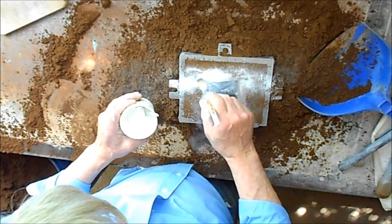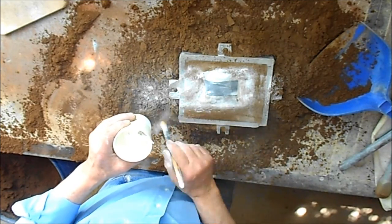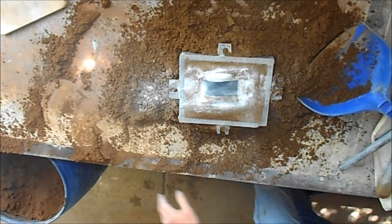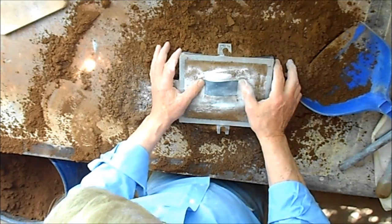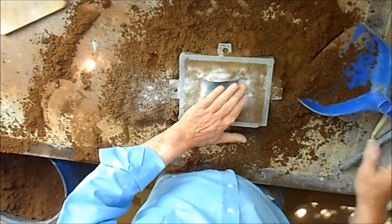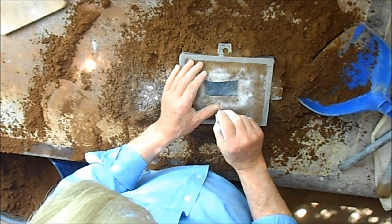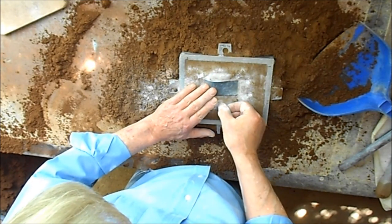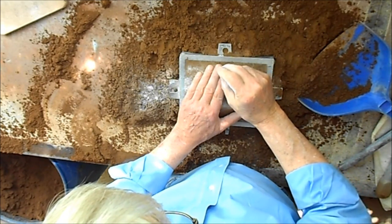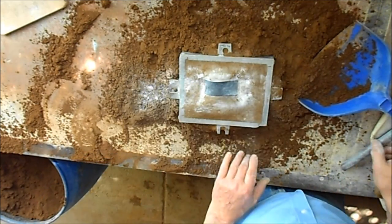A little brush down with a bit of parting agent. That's better, now I've got some air. That doesn't look too bad. I've noticed that when you add bits like this, they do tend to fall off. So sometimes a good flathead nail or two helps hold them down. A bit long, some of those, but maybe they'll just pop in at a bit of an angle. You should remember to take them out of the sand afterwards, of course.